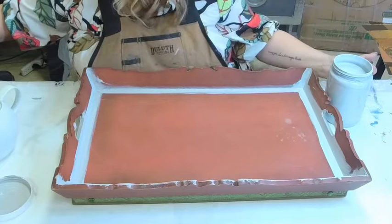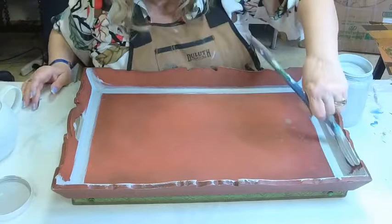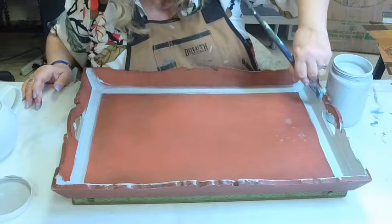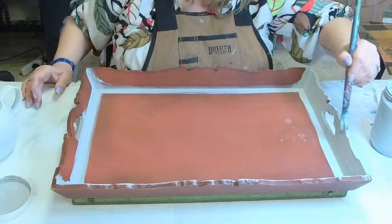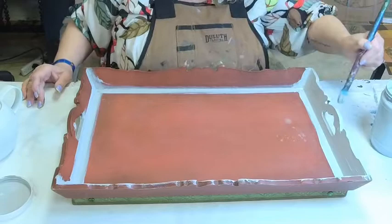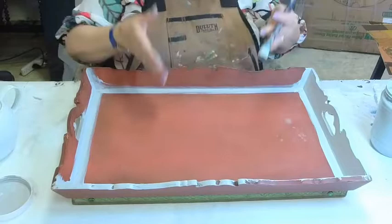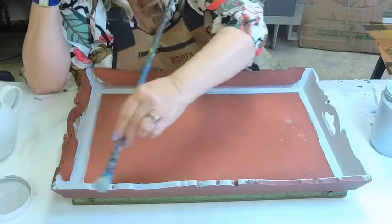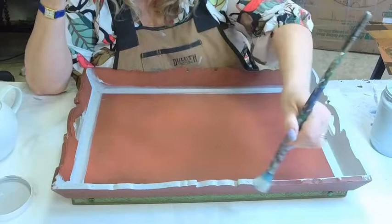Hi Barb, Williams, and Cindy - thank you for coming in. So like I said, this is not going to be one of our more glamorous lives because I'm just basically going to be painting this gray, but this is a primary step especially when I'm changing colors so substantially. This is like a barn red - I cleaned the tar out of this thing. I did a test to make sure the paint would adhere, but if I paint blue or white over this right now that red color will read through. What I'm doing is neutralizing it with gray so I can go over it with other colors without that red reading through in any way.